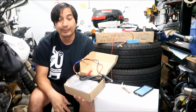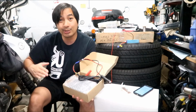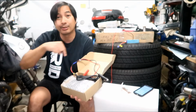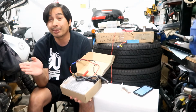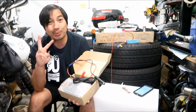And then that should help also. That should balance the battery also. So the cells with the higher charge will discharge and charge the cells with the lower voltage, and then it'll actually balance itself out. So we can also do that if we do build the battery pack. We just have to take it apart again and put it in parallel. So that's the two plans that I have.